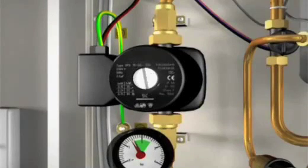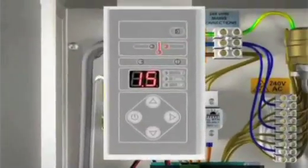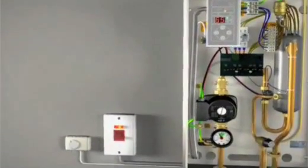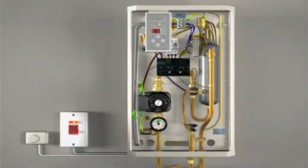After all the air has been removed from the system, the boiler's main power supply can be switched on. The boiler's software version will be shown on the front control panel, then the control panel will stabilise and show the system temperature setting. Turn the room thermostat up and make sure the programmer or timer is in the on position and asking for heat. The boiler will start operating and you'll hear the water being circulated around the system. Further bleeding of the system and pump may be required. Allow the boiler to run with the cleaning solution for a minimum of 1 full hour, or to the manufacturer's instructions, before switching off.